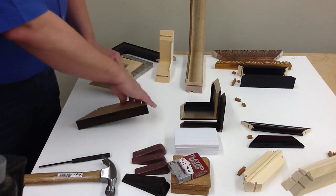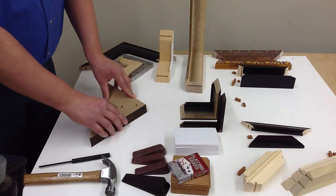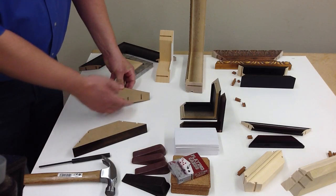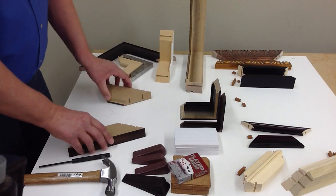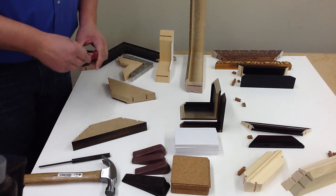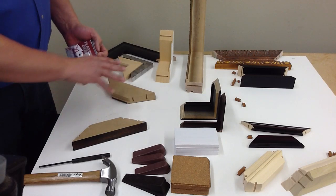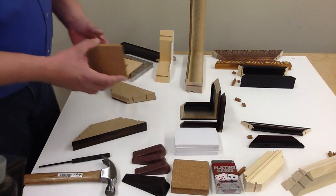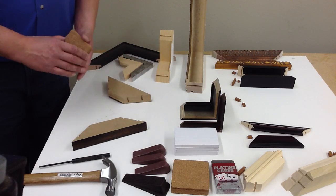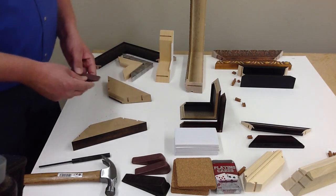The way to assemble profiled molding — the molding tends to fall down. If you try to assemble it with a key like that, you will never get a nice tight front joint. You need to bring the molding up so that it is straight and support this area. Over the years we have tried a couple of different things: a stack of playing cards in different heights — it works okay, but playing cards are fairly slippery, making it difficult to get the right thickness. Cork coasters work very well and give nice support, but they are fairly thick and difficult to line up just right. We have also used door stops.